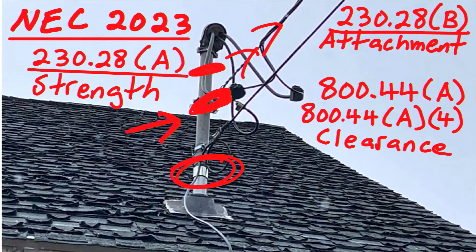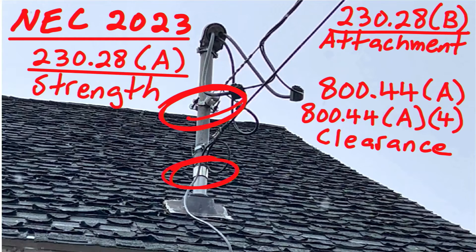You can agree or disagree with me in the comments. I'd like to hear what situations required you to put a coupling above the roof. To repeat clearly: we've got this coupling down here — that's a weak point. We've got the point of attachment over here with all that pulling tension. This coupling is a weak point; it's not good. Please don't do that on your installations.